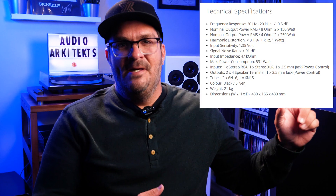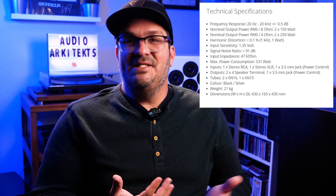The first step is to check your new speaker's specifications. The manufacturer will write out a section on their website in words and acronyms you may not understand, but it will look something like this. It looked like hieroglyphics the first time I encountered this little box of science and math. However, this box will be absolutely essential when trying to find an amplifier. We'll begin by discussing the speaker's efficiency, sometimes referred to as sensitivity, which is measured in decibels or dB on the spec sheet. Companies measure the efficiency of a loudspeaker by placing a microphone one meter from the speaker and providing it with one watt of power.